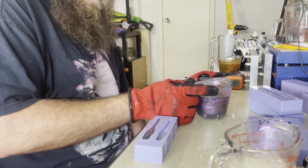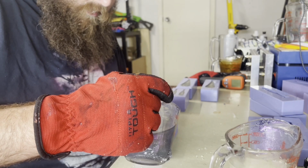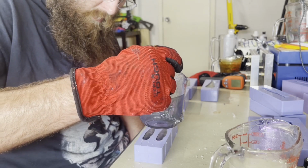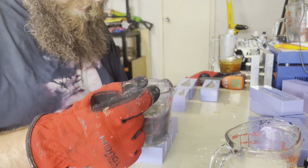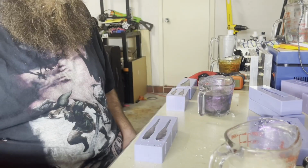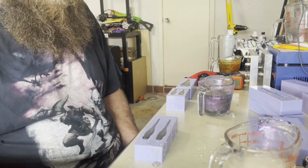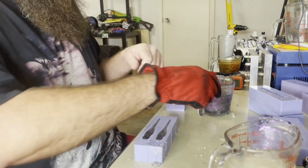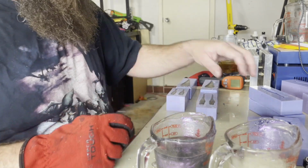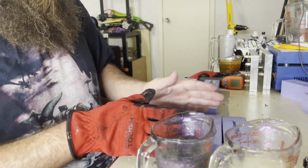All right. Nice clear belly. All right, that one came out pretty good. Over poured a little bit on the front end. That's okay. What you can do when you over pour these is just whoosh, a little off the top, just like that. All right, so we'll set this guy aside. Now, tombstone kickers, and I think we got enough plastic to do all four of those.